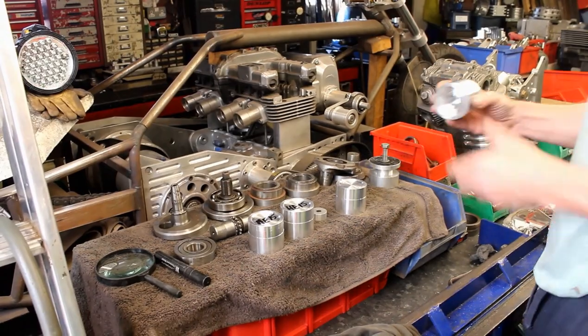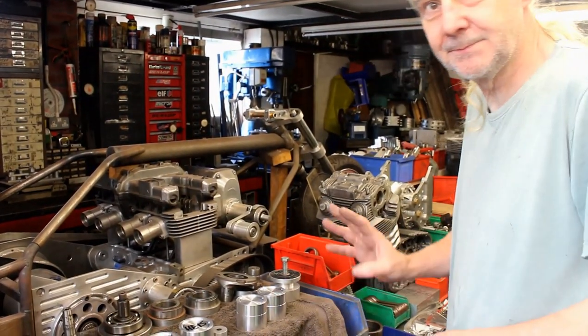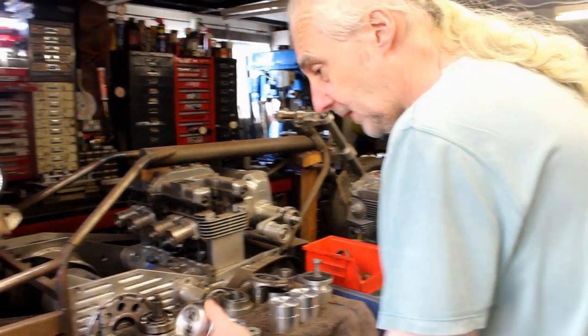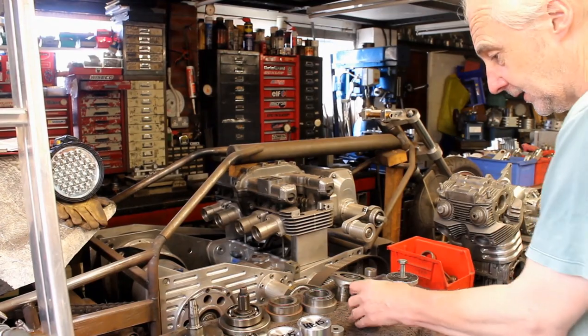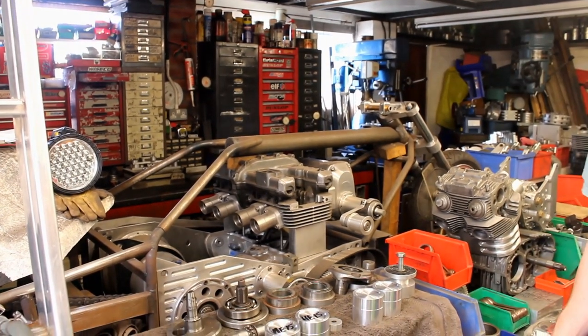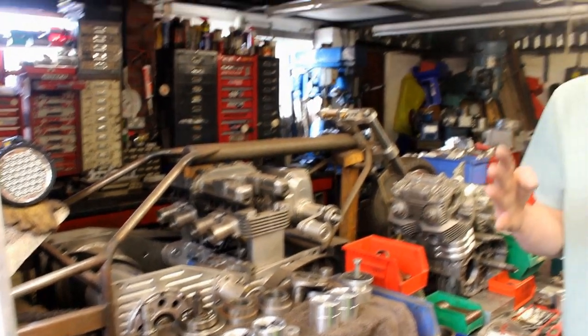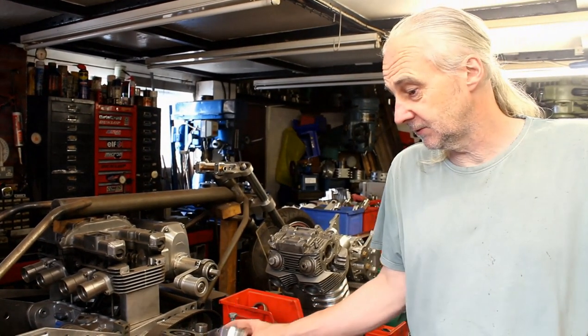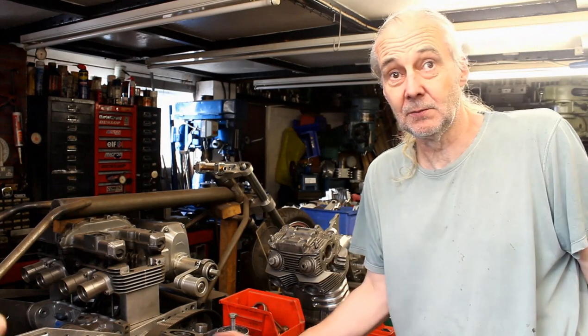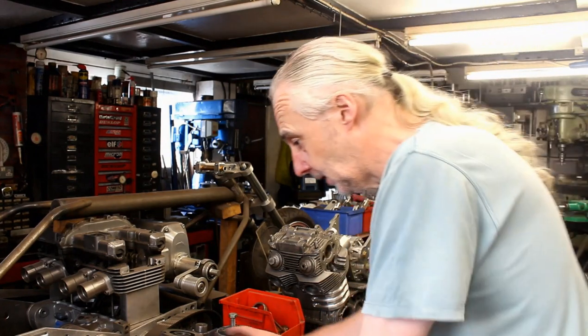You can tell when you're machining it, there are slight differences. Does it just feel a bit different? Well, one might be fractionally softer, because it's got different grades of copper and whatever in it, and the other is harder. If you set the machine and put one in the centres to machine it, you get two different sizes without even moving anything on the machine. Right, okay. Different grades of any material. I was surprised how heavy they feel, because obviously they're still quite solid.